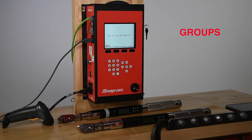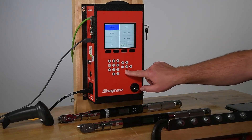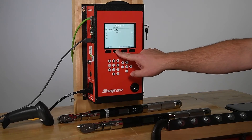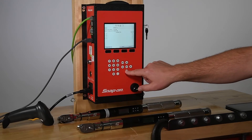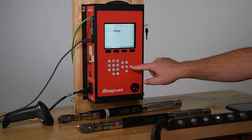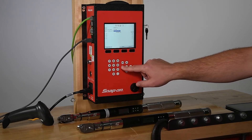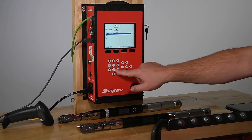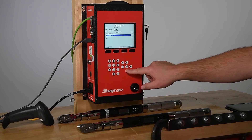Up to 4 parameters can be grouped together if we want multiple wrenches to be controlled simultaneously. This feature can be useful if we have multiple tool operators performing tasks at the same workstation. Keep in mind, each parameter in a given group must be associated with a separate wrench. To group parameters together, go to the menu, select Groups, and choose a square. Up to 100 groups can be set. When you've highlighted the group number you wish to use, press the Edit button. The group can be named, and we could also choose to lock on batch. A group is defaulted to beep on batch completion to notify operators when the group is complete. This can be changed to parameter completion if operators prefer. Parameters can then be added to the group — remember, each parameter must be associated with a different wrench. When the setup is complete, press the Save button.